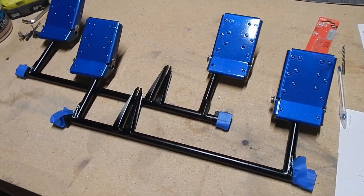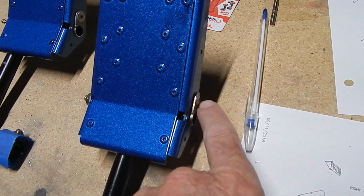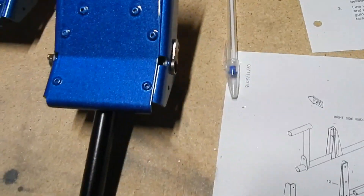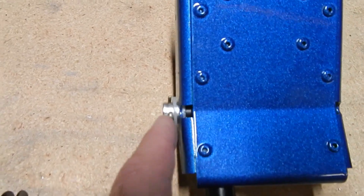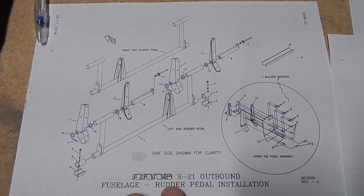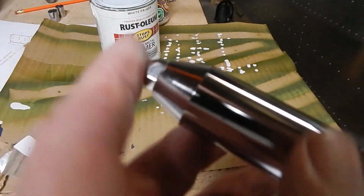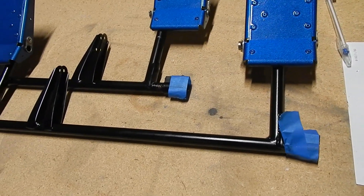The next step is to get these rudder pedals onto these assemblies. There's a swivel bolt that you put through here, some plastic washers—three washers—and a cotter pin that holds it in place. I did have to drill out with a half inch these holes on the side of the pedals; they weren't quite big enough. I had to drill out the cotter pin hole with a number 11 a little bit. There's a big 316 stainless steel rivet that goes in the side. For that I had to change the nozzle on my rivet gun and I used about 95 pounds of pressure. It's a tough rivet to pull.